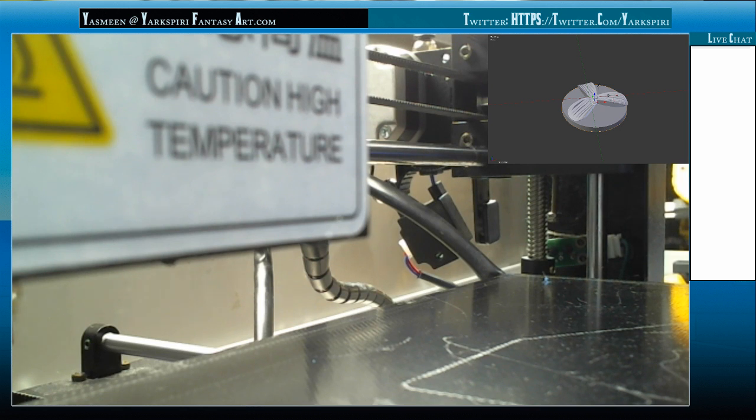Also, you can tilt the print to get a better resolution if you need to. But because of how I designed this, the only type of supports that are needed in this case are right in this little tiny corner here. It's just underneath here, and that gives it a bit of a sharper corner. What I did do compared to the original design is extend the base of the item, and that's specifically to help prevent the need of any support material. This makes the overall piece a lot stronger in the long run, and it causes a lot less problems with the printing process.